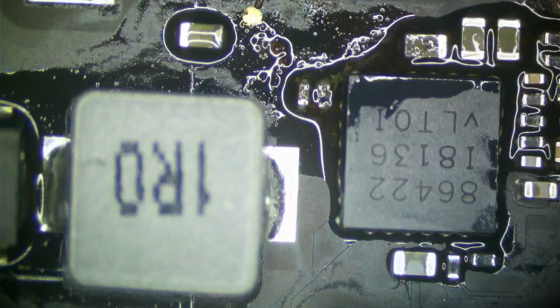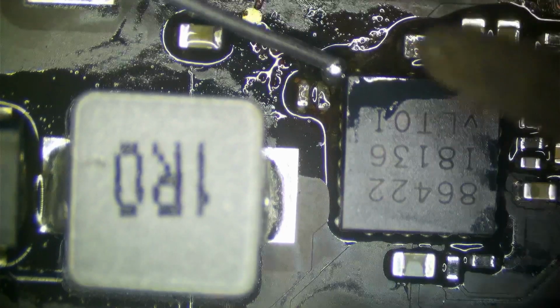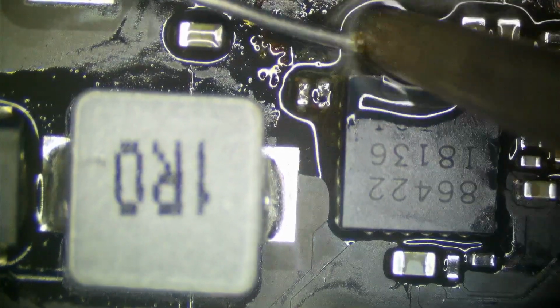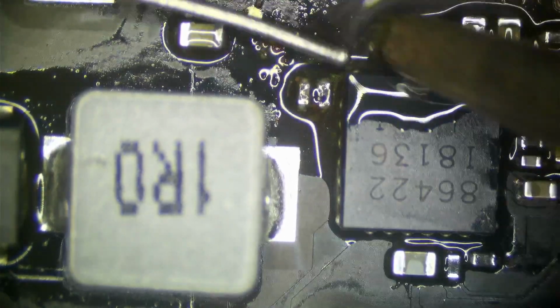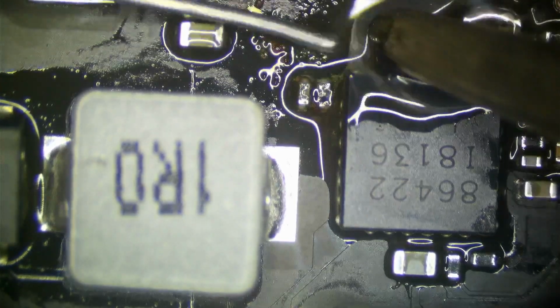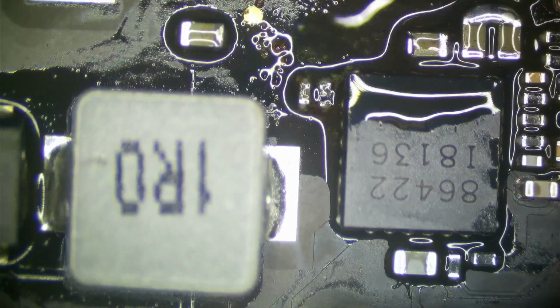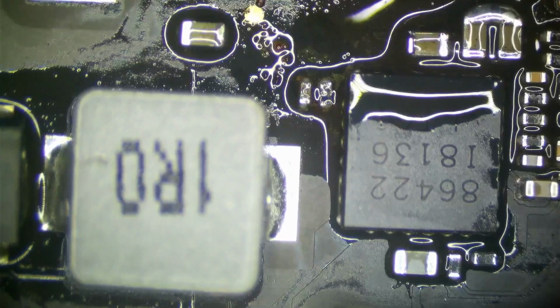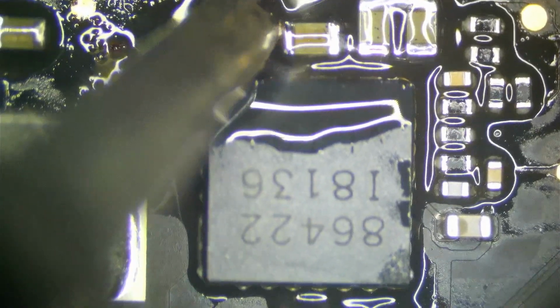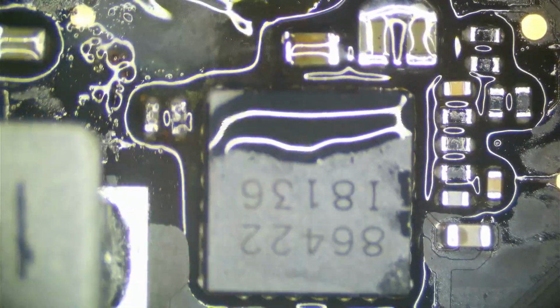So we have either choice of knocking it off or leaving it on. Now certain capacitors, not all capacitors, can be just left off. So my rule here is if I can clean these guys up so they're nice and shiny, then they should be okay. Sometimes you can actually see when the ceramic capsule in these is infiltrated, and that's not okay. A good example is the one that I showed you earlier.